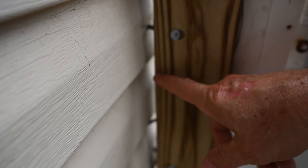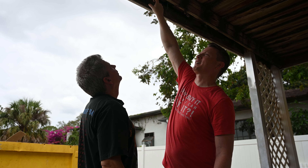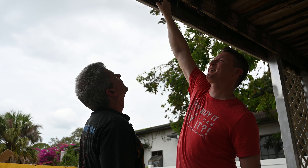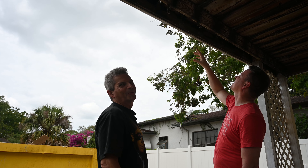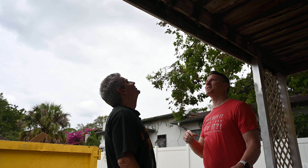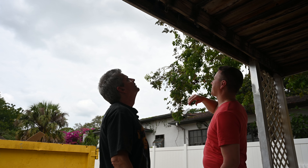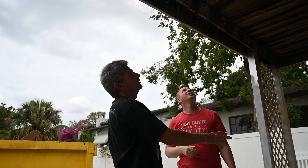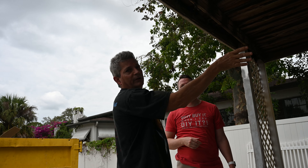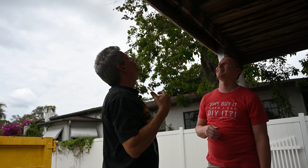You can see how these screws are spaced — very weird the way that's done. They actually have some hooks here for hanging — listen to it creak when you do that. Imagine trying to hang a swing on here — that would be deadly. This is all held together by fasteners and screws, and nothing is actually sitting on top of a support beam or post. If you hang a swing on your own deck like this, please put up a ring camera and capture it.